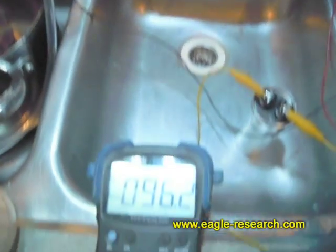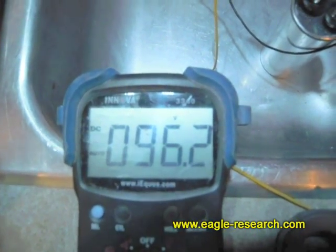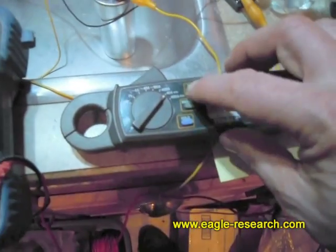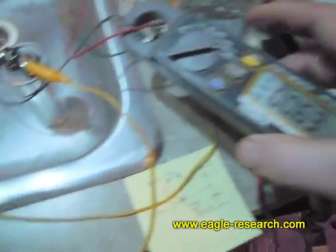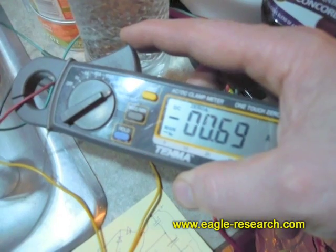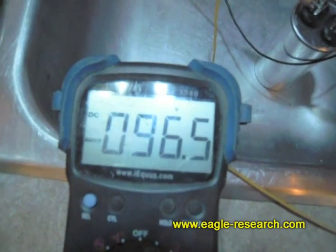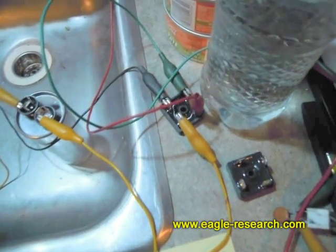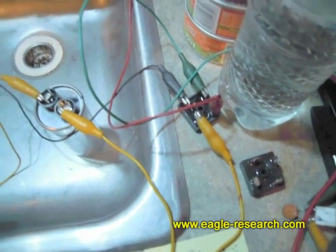In this particular case, we have 96 volts DC going across the electrolyzer with one 40 microfarad capacitor. We have this set on a DC scale on the amp meter right now, so we'll check the amps — it has 0.69 of an amp going in there. That's DC 0.69 of an amp, and 96.5 volts DC, so that's the load. Of course there's an extra volt for the full wave bridge rectifier voltage drop, and if you're being really accurate, you'd figure that in too.